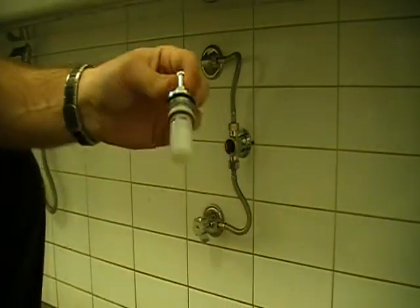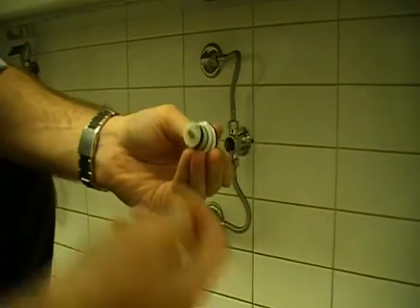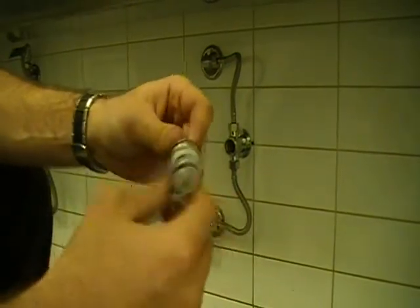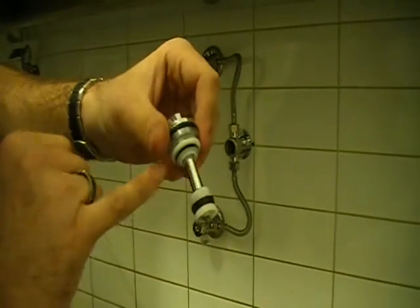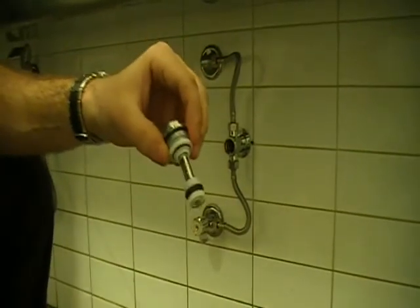I have my new cartridge here now. Taking off that plastic cap and making sure everything is in order — the spring has no cracks or damage at all. We also want to make sure it is well lubed in this area here, with no calcium build-up, rust, or any damage.